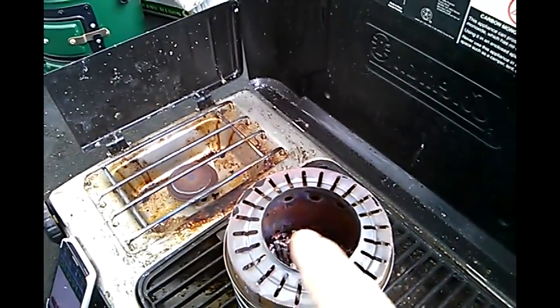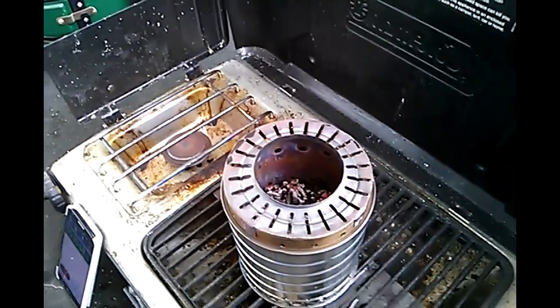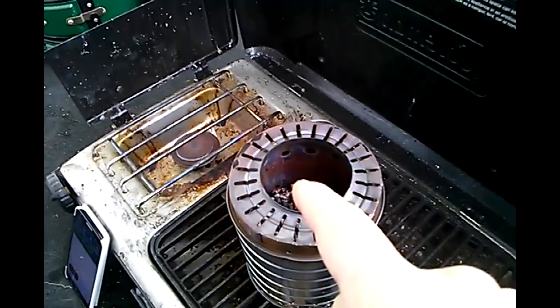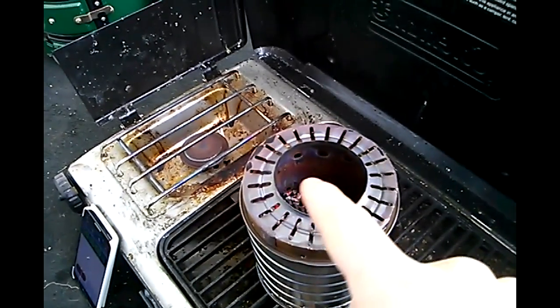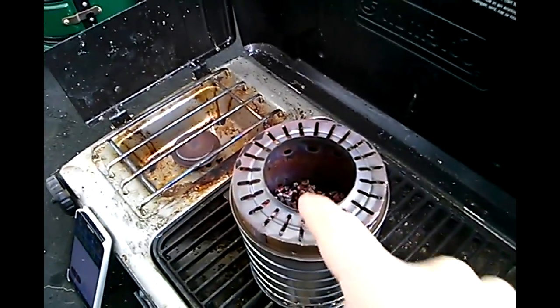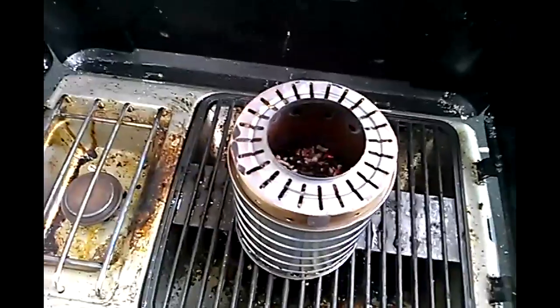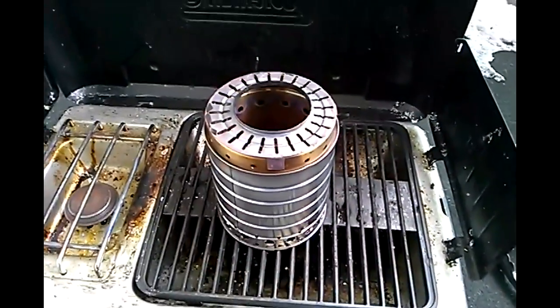I did start to see a little bit of smoke as I got towards 30 minutes. You can eliminate that by probably making bigger air holes in there for the secondary air, and probably right at exactly the halfway point between there and the very bottom grate. Okay, so if you guys are doing your own, I would suggest that. But overall, very happy with how it burned.